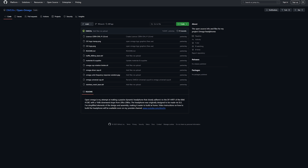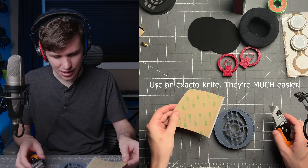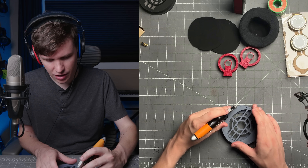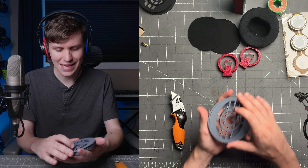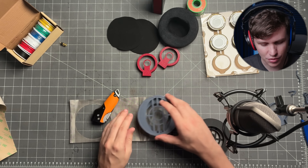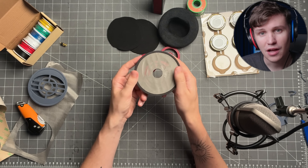The first thing is to take this piece and use the adhesive with it. You can laser cut this adhesive using the DXF files on the GitHub page for diode lasers or anything else, or you can just cut it out with an exacto knife to fit right over the baffle. When you have this on here, put the piece on, cut around the edge, then cut out all the individual holes — but make sure you leave the adhesive on the individual bar pieces. Everything that's open, the adhesive is removed from, but anything where you see a bar needs to have adhesive on it. Then take your stainless mesh, cut it out to the size of the baffle, and cut a hole out in the middle. It's a little bit easier to cut it out, stick it onto the adhesive, and then cut the hole out of the middle. What you'll be left with is adhesive and stainless mesh on the baffle.